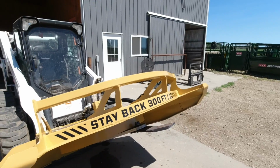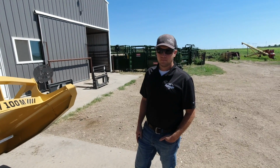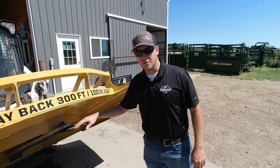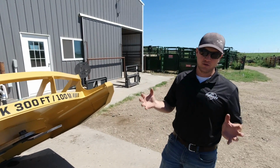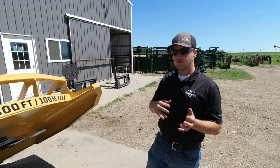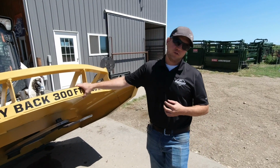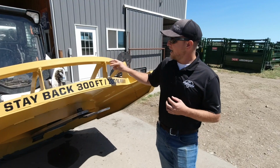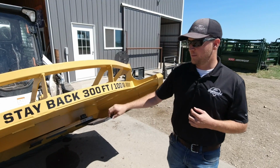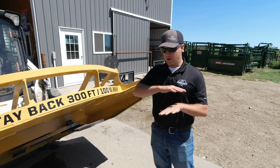Appreciate that. We have a standard flow hydraulic system on our skid loader, and so you guys have different motor sizes to accommodate that, or how does that work? Yeah, that's exactly right. So you brought it up, with the speed of these blades. So what we do is we match the size of the motor to the amount of flow that your skid steer kicks out. It's actually one of the things that differentiates us from a lot of the other players in this market space. So we would consider this one of our two standard flow options. And what we're doing is sizing this motor to your standard flow circuit on your S250 to get the ideal tip speed. If we used a motor that was a little bit too big, the blades would be going slow enough that it wouldn't cut very cleanly.